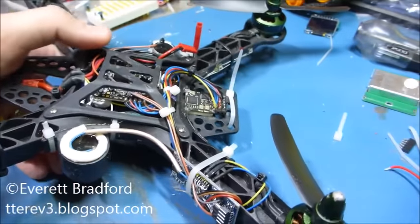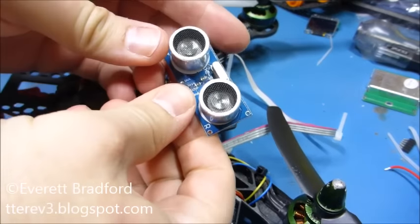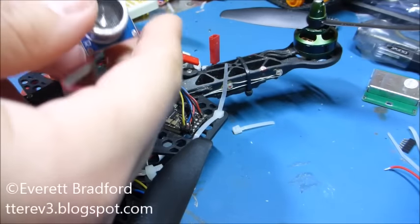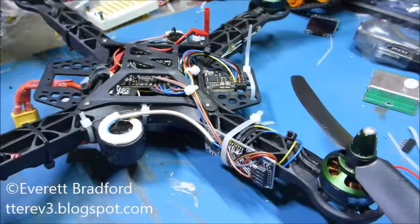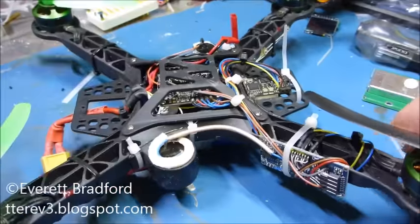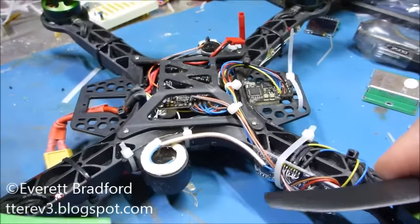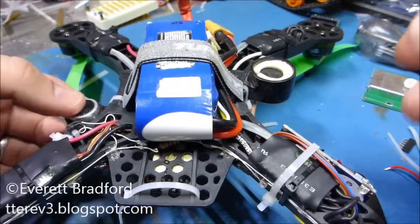What I had done originally was use some of these cheap HC-SR04 sonar modules to try and do it, with my own board talking to them and doing the signal reading and generation for the throttle signal. I discovered through a lot of frustration that there are a hundred different things that interfere with the use of sonar on a quad — electrical noise, air currents, temperature changes, acoustic noise from the props, moisture in the air — just all kinds of things that cause an unbelievable number of problems.